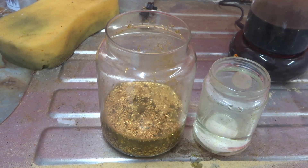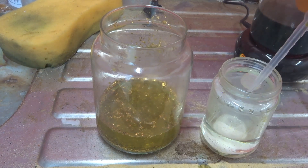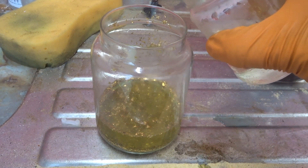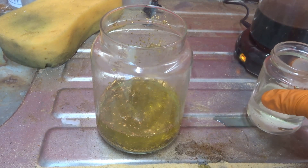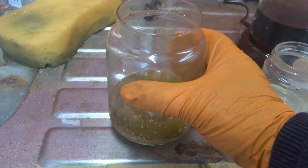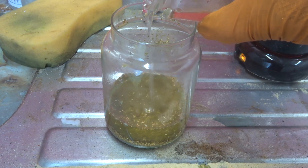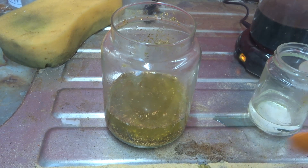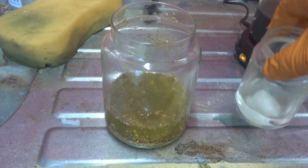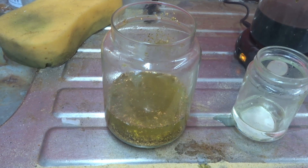No reaction yet — I'll leave it a few minutes and see if any reaction starts, then if not I'll add a bit more. After leaving it a while and it hasn't really started to react, I'm going to pour in a little bit quicker. There we go, I think we have a little bit of reaction starting. It's usually a three-to-one ratio, so that's what I have — one part nitric compared to three. I don't want it to boil over, so that's why I'm adding it slowly.